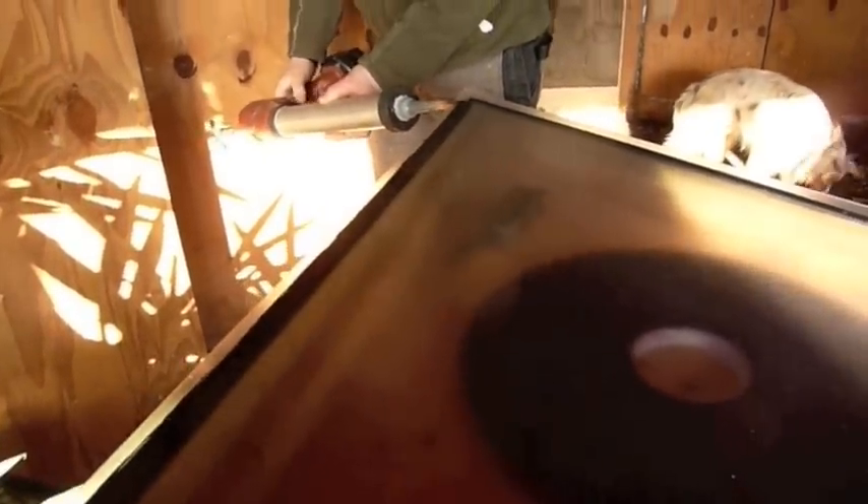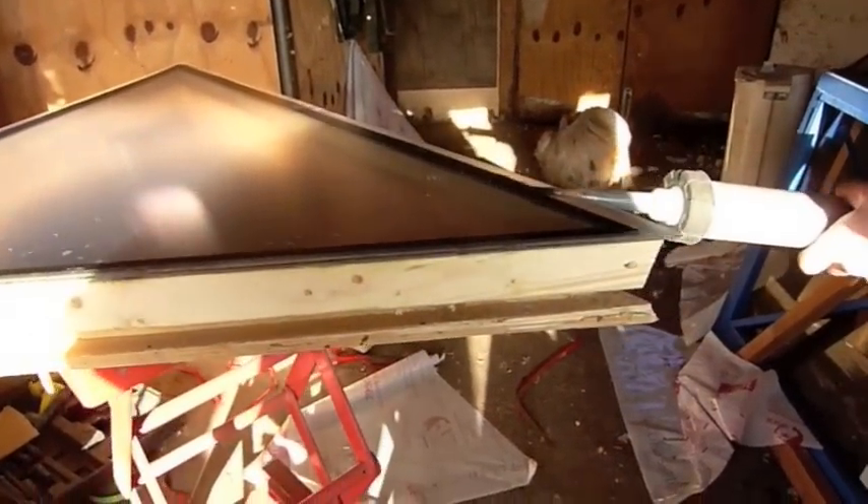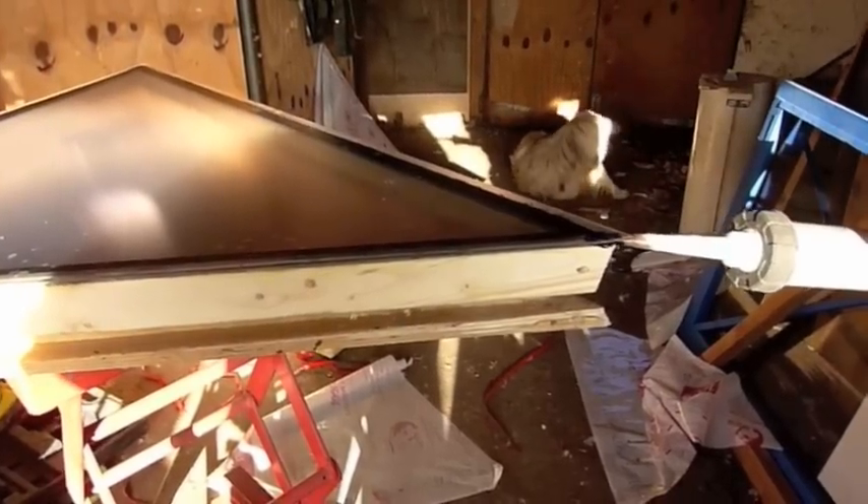Once you have got that on, we need to apply silicone behind the polycarb and to the wood. I am pushing the silicone in behind the tape. This makes a nice neat square line and effectively glues the polycarbonate to the frame. You can see that the polycarbonate is slightly bigger than the actual frame — we will trim that later. This will take maybe a couple of days to cure, so just stack them up and leave them like that.